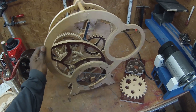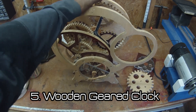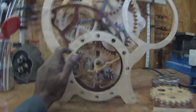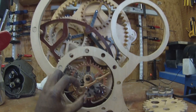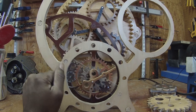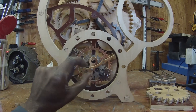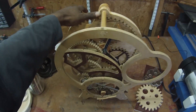The last thing I want to tell you about is my clock. There are no washing machine components in this clock but there are quite a few salvaged components, which is sort of the theme of this video. I've got my hour and minute hand and a Geneva wheel which drives the hour hand relative to the minute hand. Many of these gears are made from sample pieces of hardwood flooring — they have a nice thick top layer with a nice finish already on it, and that's where the idea started.